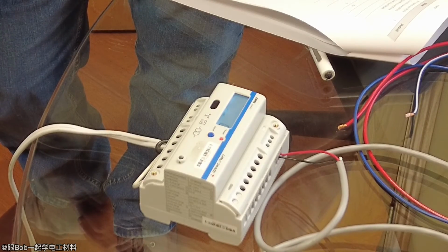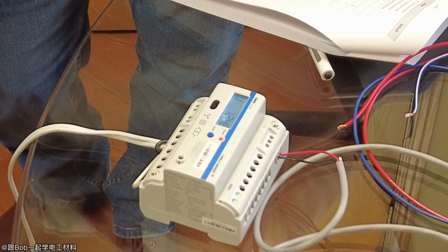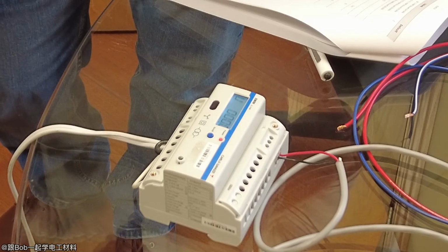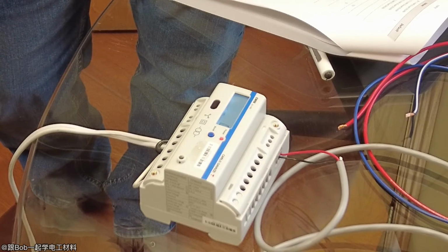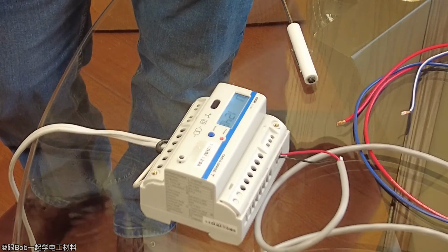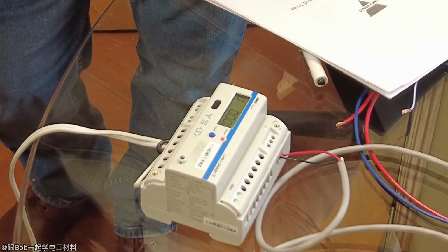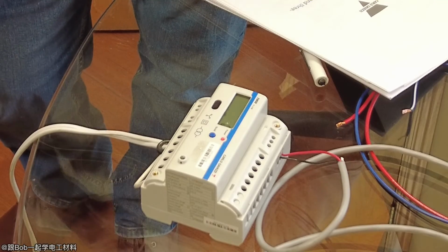Yeah. Normally they use color. Yeah, they do, but people still do it backwards. That's why if you look at ours, we tell you which side's the high side of the CT, and which side that corresponds to on the output. Okay. And but still, if they wire the wire the wrong way through, it's still going to be wrong. Yeah. So you either reverse the direction of the wire or you reverse the CT direction, one or the other. Okay. So really, that's all there is. It's basically just a matter of following along on these 3 pages in there. And again, the only thing people are probably ever going to change is the Modbus address and the CT ratio and the system type. Okay. They probably won't change anything else in here.